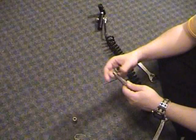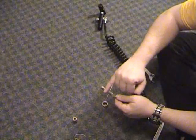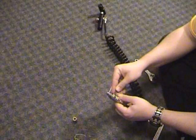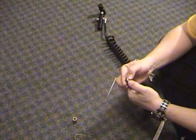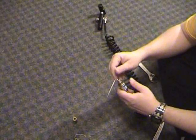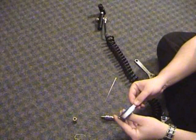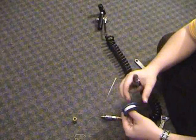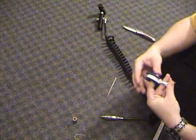Seat the O-ring in there, then clean off the body. Make sure these surfaces have no burrs because they will start to chop up your O-rings if not completely smooth. Put the O-ring back in place and make sure it's in its groove. Clean all the dust out from the threads, then pick up your Teflon tape — also known as plumber's tape — and cut enough for about two to three rotations around the thread.